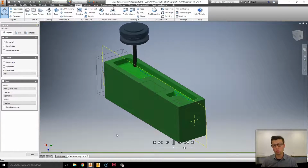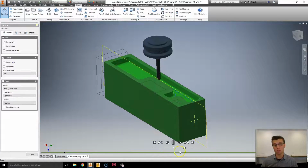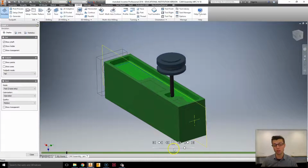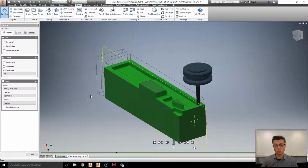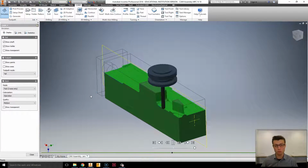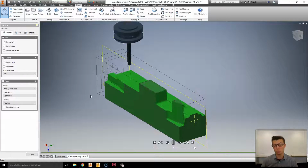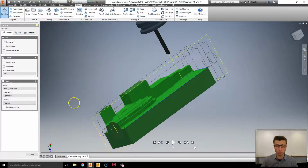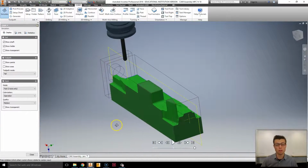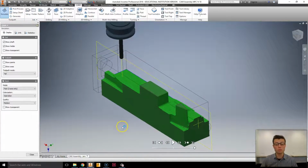All we're doing is trying to remove material so that there's less in the way when we do the finishing pass, because then we can do that finishing pass very fast. I'm going to speed this up with the speed up option, and have a look at it and check what it looks like. It looks pretty good. You can see how a block is turned into an object that we've designed. Obviously that's very rough looking, and this is where we're going to go now and do a parallel pass, which will be our finishing program to make sure that it's really accurate.